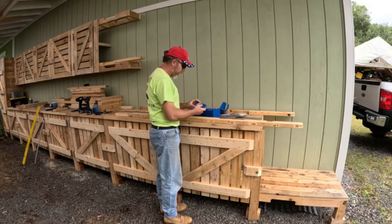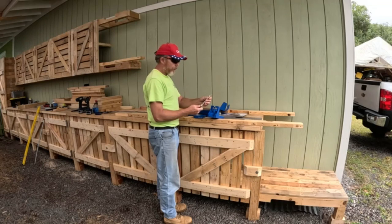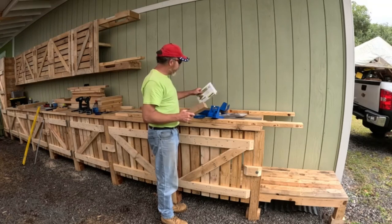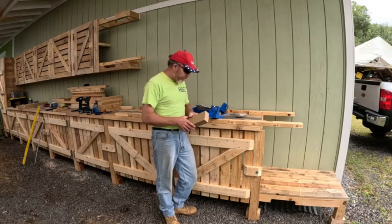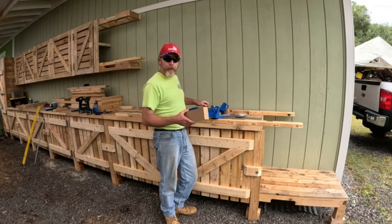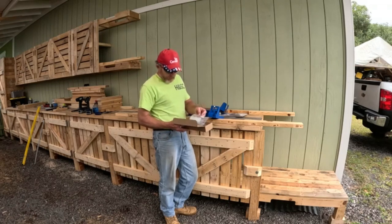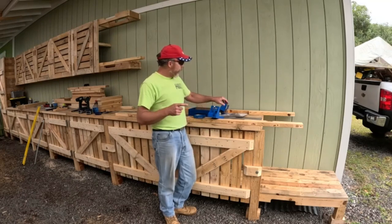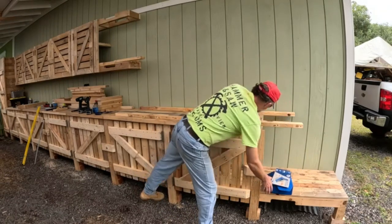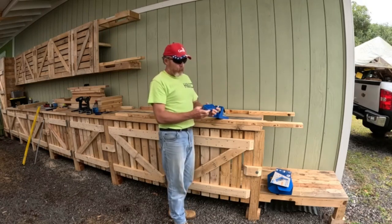I'm not going to mention the company or the subscriber because they didn't ask me to. It's a simple little unit. You've got a depth adjustment; it comes with a drill bit that's offset for the screws. It comes with instructions. There are some other parts and pieces — like some templates, a little driver piece, square head screws, and wood plugs. But what we're interested in is only a few pieces: the main body, the Allen wrench to set the collar on the drill bit depth, and this little guide block.